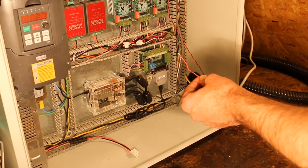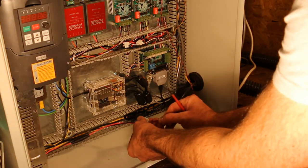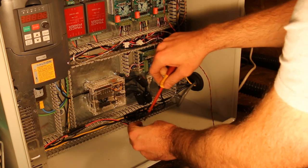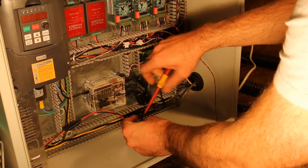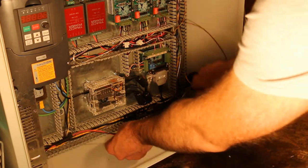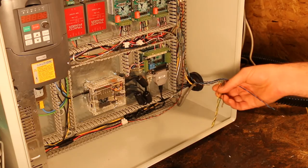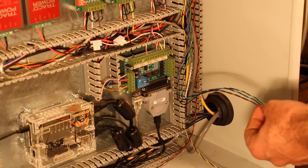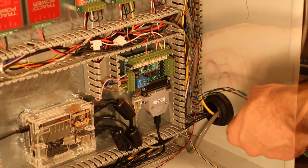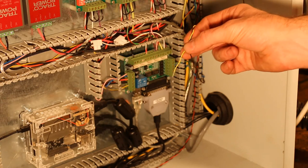Then we connect the red and black wire from the main unit to the power supply via the fuse assembly. The four remaining twisted pairs connect to the breakout board. The green, blue, and brown twisted pairs connect to the inputs on the breakout board. Then I connect the yellow and black pair to an output signal on the breakout board — this is for the anti-dive signal.